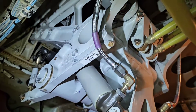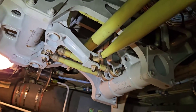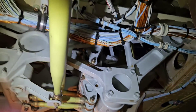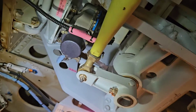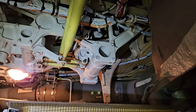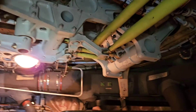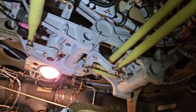You may ask why we have only one set of master cylinders when we have two sets of pedals. The answer is that pedals which cover rudder and brake controls are interconnected between the captain and first officer. That's why on this classic A320 we have only one set of master cylinders. By the way, only these controls are interconnected because side sticks are fully independent.